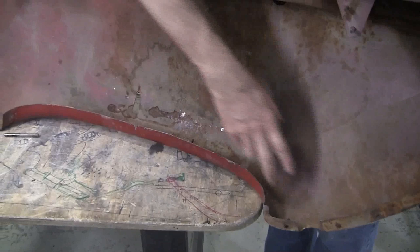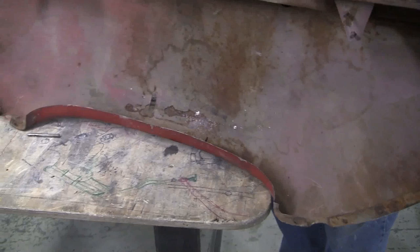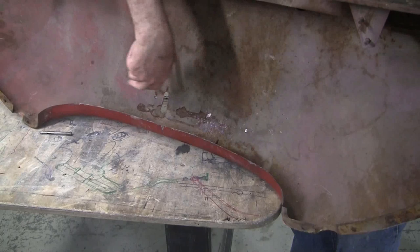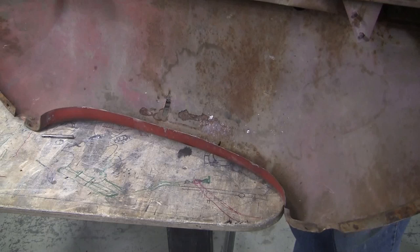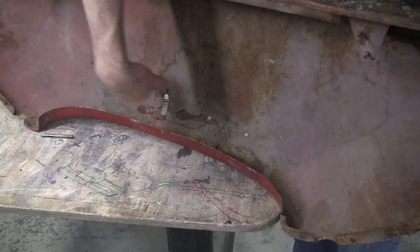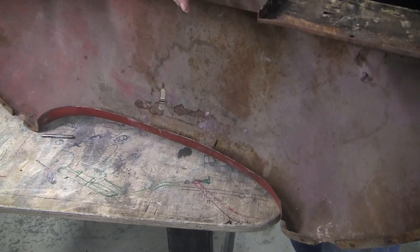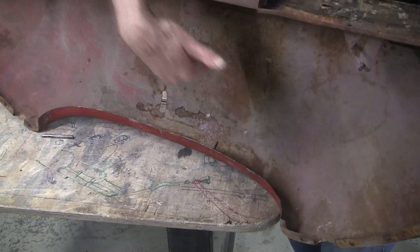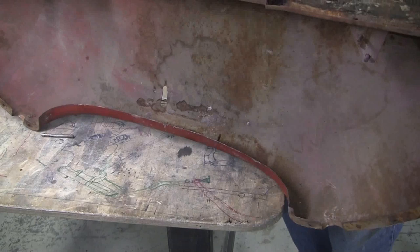Again, it's cleaning it up a bunch, throwing on a mold release, which I use a heavy wax to do, and then we fit in 1/4-inch hot roll wires, MIG weld it all together, probably put 4 or 5 wires in there, and then have a couple stands and legs for it to support itself, so it's in a user-friendly situation. And after you get all the wires done, first you put a big heavy coat of that reinforced Bondo in there, the waterproof Bondo, and then you plunge the wire form into it, and then backfill all the wire form right up to this lip, and you get a perfect mold. After about 10 minutes, it's all set. Boop, it just pops out because the wax releases it.